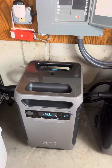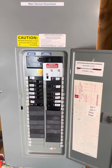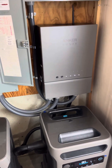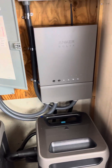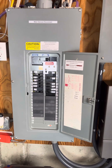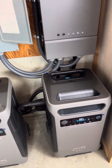I also have a back feed for my generator. I'm getting ready to replace my generator and put a new one in. They do sell a generator cable that you can get with the F3800+, and it would work with the home power panel, but only if you only have one unit. Since I have two, you don't really have a place to plug that generator cable in. So what I've done is left my back feed in place, and I'm going to have an inverter generator that will back feed. I've already tested it with the generator I have, and it will charge the F3800 — you've just got to be able to see clean power.